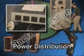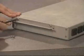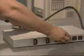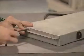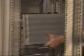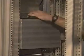In addition to cable management kits, Compaq offers a power distribution unit, or PDU, that manages power distribution and facilitates the consolidation of power cords and cord management within the rack. The PDU distributes AC power input from one or more cords into multiple electric receptacles. The PDU is uniquely designed to mount in the sidewall of a rack, saving use space for more critical servers or options.